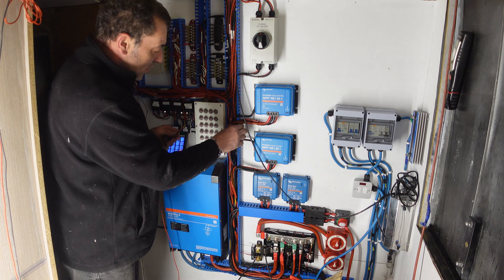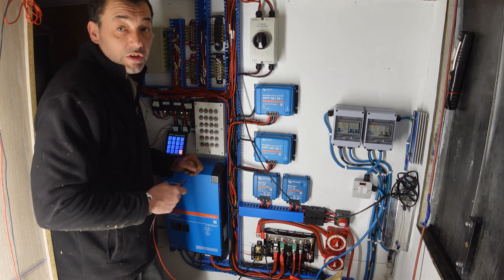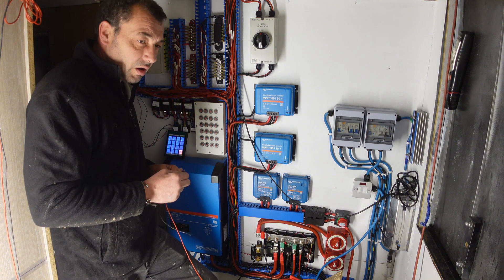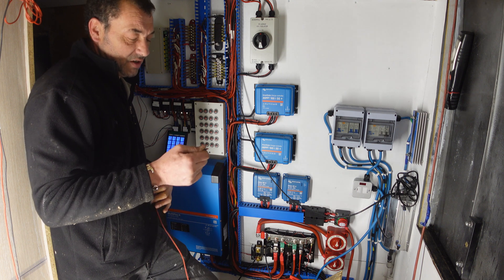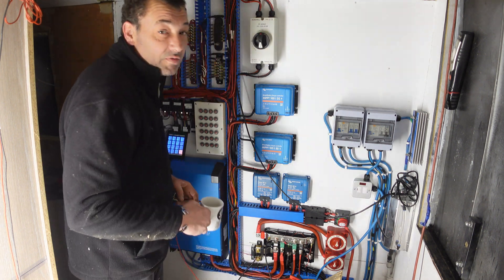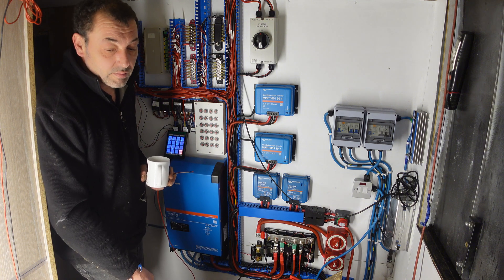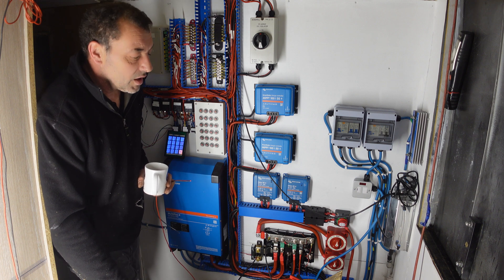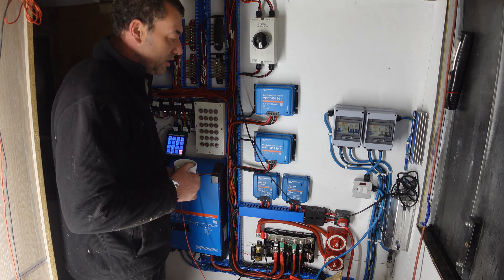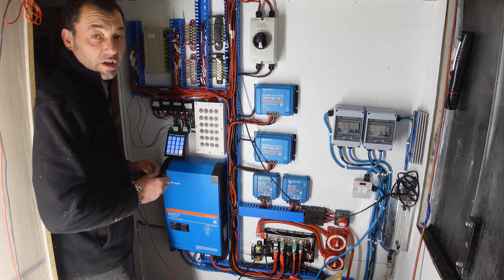There's just one thing I'm wiring in that I'd forgotten about. Basically the Multi 2 has got a trickle charge outlet for charging your start battery. It's supposed to be 4 amp, but I've also seen somebody do a test of it and it was 0.4 amp — which is like half an amp. It's enough to over a long period just maintain a start battery. It's not a massive amount, but if it is 4 amp — anyway, a dealer's told me that it is 4 amp.